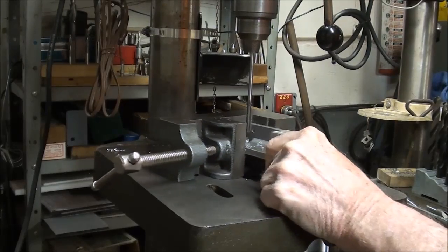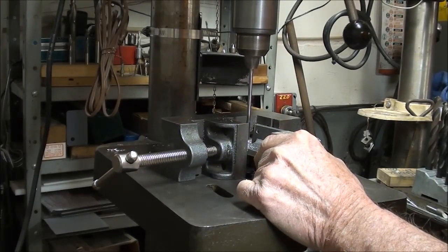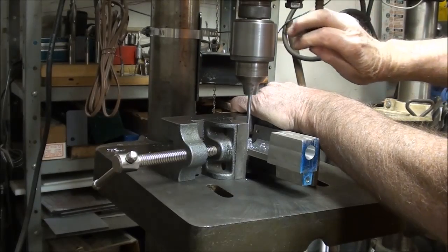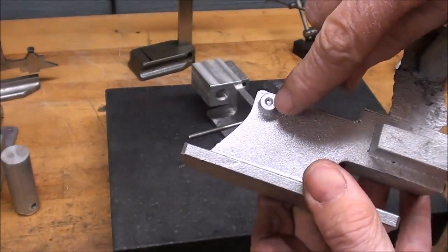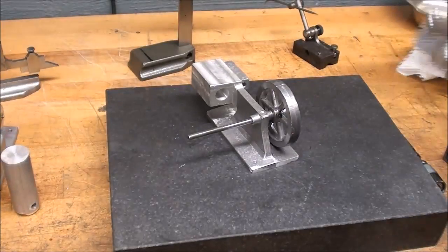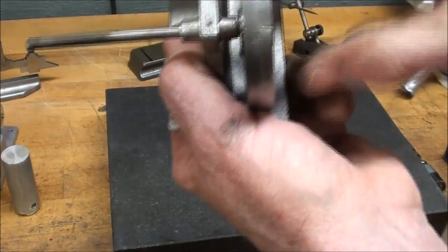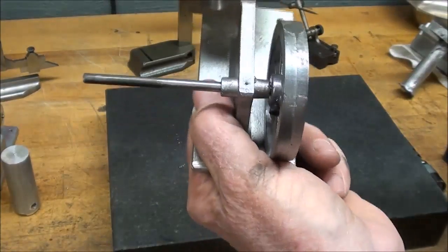I just float this around — that was a pre-cast, or pre-center-punched hole. As you can see in this rough casting, that hole was actually cast in. In other words, I pre-located it when I designed the pattern. So that hole was drilled and reamed. This is a rough flywheel that hasn't been machined yet on the periphery anyway. And then I drilled a 1/16th hole for oil and countersunk it just a little bit with a hand countersink. That's how I'll oil the main bearing.